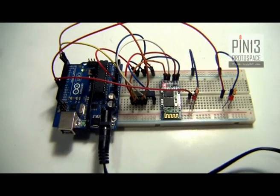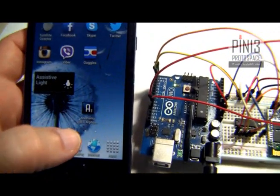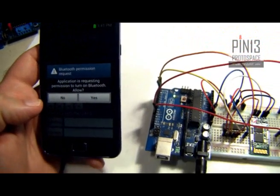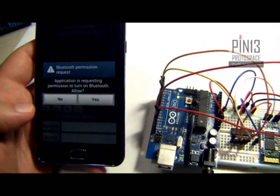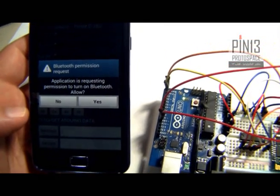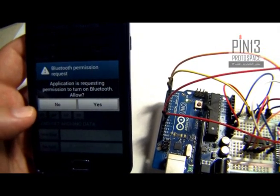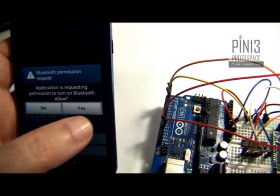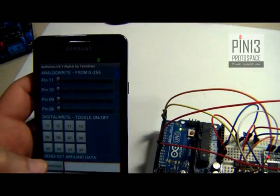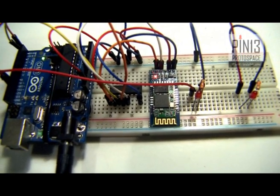Let me run Androino. If you have Bluetooth turned off on your Android phone, you will be prompted to activate it. If you run the application for the first time it will ask for permission to access your Bluetooth — meaning the application wants to be able to turn Bluetooth on. We will say yes. Bluetooth is now turned on but we're still not connected to the HC05 Bluetooth over serial module.